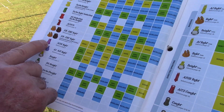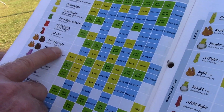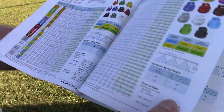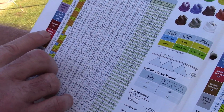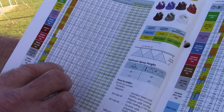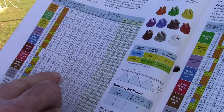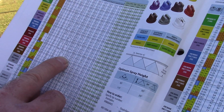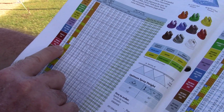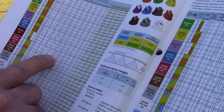The XRC means it's the tip with the cap already on it. If you know you have this tip, the chart refers you to pages 12 to 13. A very popular size is the 80-04 or the 110-04. So if you want to put out 20 gallons per acre, you find that on the chart and you'll see you need to drive six miles per hour to get 19.8 gallons per acre, which is very close to 20, at 40 pounds of pressure.